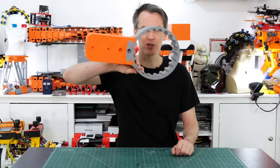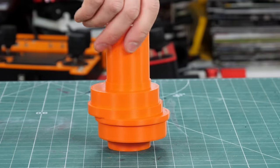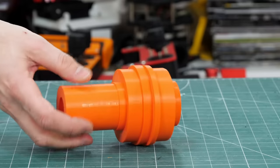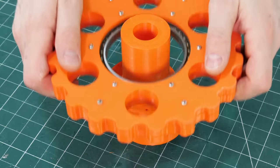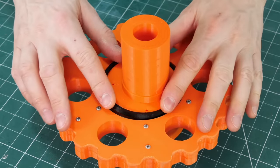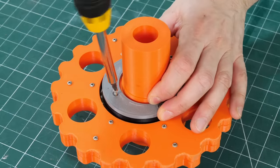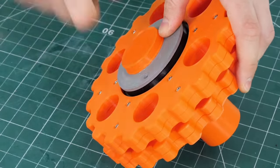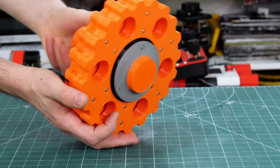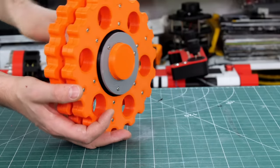Here's the new cam — it has the same cam geometry but no motor in the middle this time; it's just got a drive shaft attached where the motor was, and we'll drive that with a belt from the offset motor. The same discs go onto that and spin around — there are two of them with the collars and retainers to hold everything in place. The two discs are positioned closer together this time instead of being so far apart, so the whole thing is much more compact and works in exactly the same way as before.